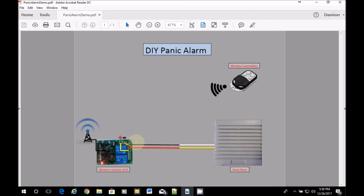Now you'll have to attach some jumpers to these channels here. This is channel 1 and this is channel 2. Now I've set up my stuff on channel 2. I could have set it on channel 1. It's the same thing, both identical. So what I did, I have 2 jumpers from the negative terminal to port C, right? Because this is labeled A, B, and C on both sides. So negative terminal, jumper to port C. Positive terminal, jumper to port A. Let's do that again. Jumper from negative terminal to port C, positive terminal to port A.